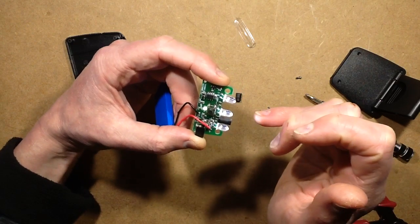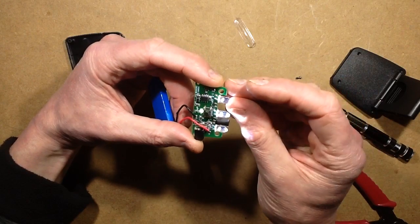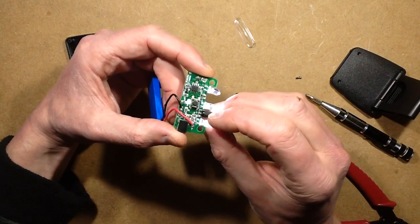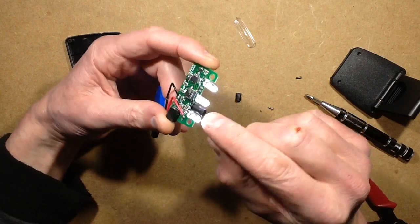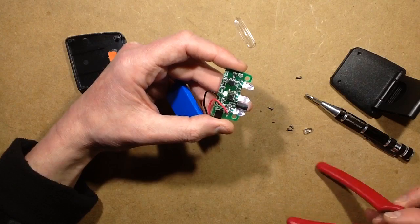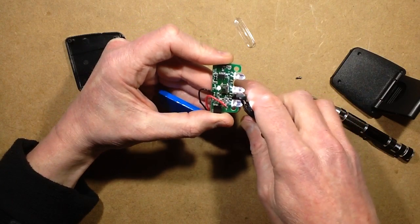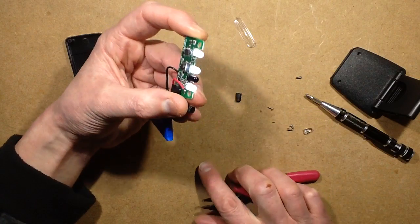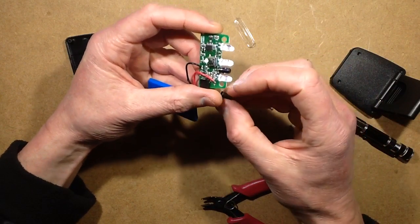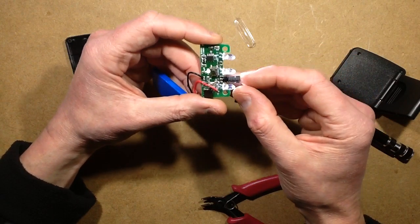Is that the receiver? I don't think that is the receiver — I think it's just detecting the slight modulation of me touching it and adding a stray input. Another option would have been to put a little cap over the infrared receiver, just blocking up the end of it. Let's take the sleeving off — it's got heat shrink sleeving just to block interference from the sensor at the side. That's a three-pin sensor, so it's obviously like a remote control receiver with power positive, negative, and demodulated signal out.